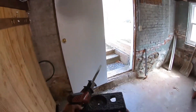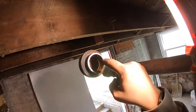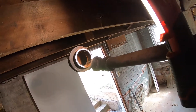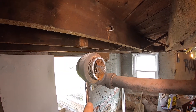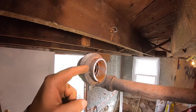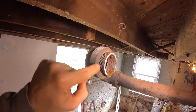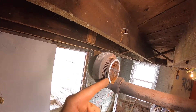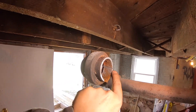Like the other side, I'm going to salvage this fitting. I'm going to take the little pie piece out of the side, bang it in, and it should roll right out. What you have to remember about this trick is that the threads are thinner than the actual remaining piece of the pipe, so when you're cutting through, you have to be careful — you may not be through the thick piece but you may already be into the threads.